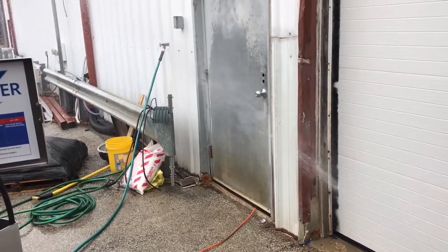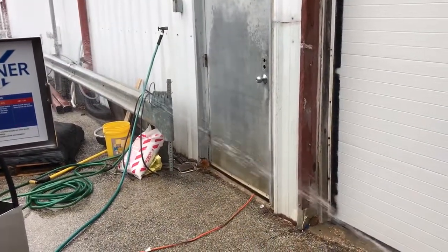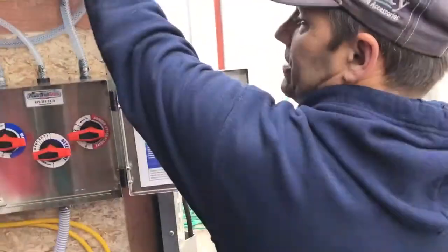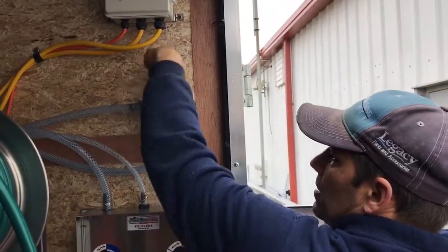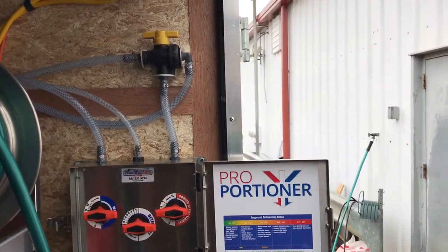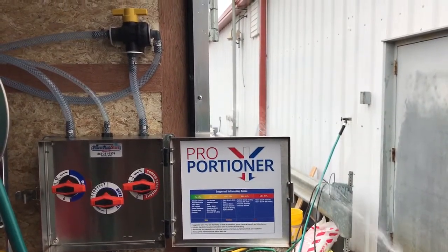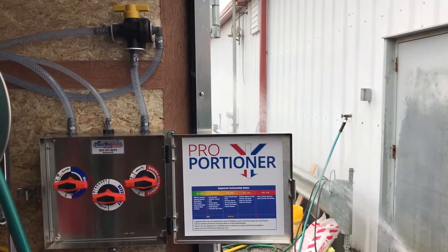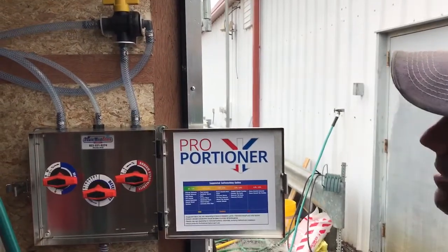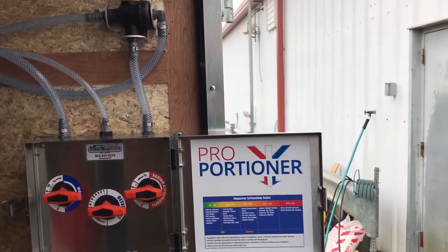Now I'm forcing the air out of the line. I'm going to hit it one more time to turn it off and go back to the proportioner draw, and I'm going to watch for the air to get sucked through — and it has. So now I'm going to take this valve up here and turn it over to the SH tank. There you go, you can see it actually sucking the SH in. Now because I got air it's not sucking really well, so I'm going to hit the button to force feed the booster pump right now. I'm force feeding the booster pump and I got the air out. I'm going to hit it again and we're going to finish sucking the SH line clean, get the rest of the air out of there. Now I saw the rest of the tiny air bubbles going out of there.